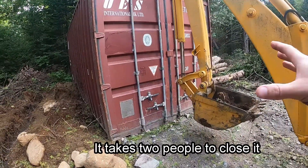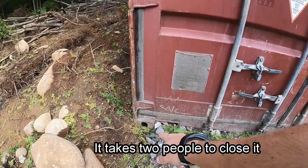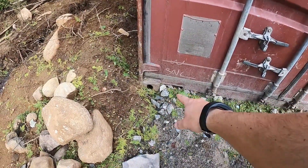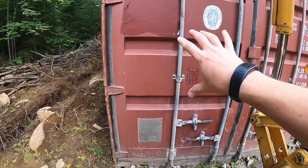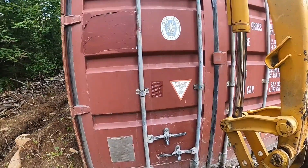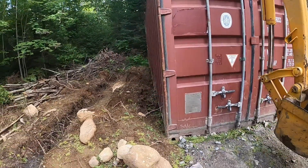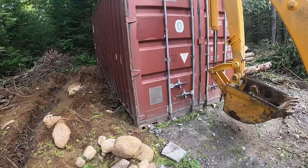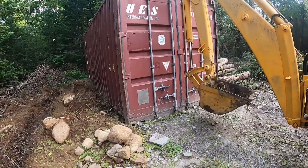So I looked online. There aren't many videos, but what I could find is if I lift this corner up about an inch, I can place this little patio slab underneath it to help shift the whole container. And if that doesn't work, I can put one in the back right corner, and that should help the front twist enough so these doors should be easy to open and close.